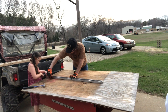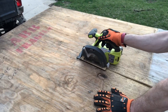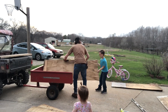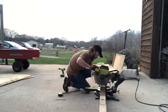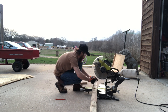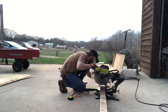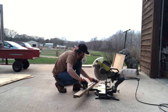Once we had measured the boards we went ahead and cut them down the middle lengthwise. We needed four sheets for the two brooders, so my husband went ahead and cut that second board while I was helping the baby with something. Then we started with the 2x4s — you're going to use these as braces in the corners as something to anchor everything to. You'll be screwing the plywood into these 2x4s using two-inch screws.